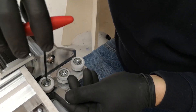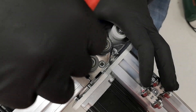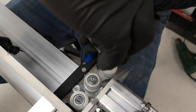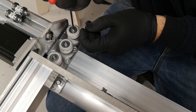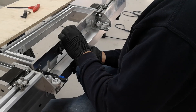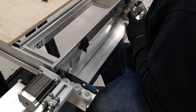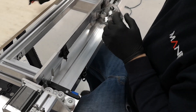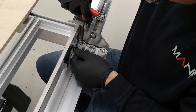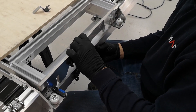Now we go and set the rest of the wheels. Initially, just get them all orientated in the same direction — get all the cams pointing the same way. Now they're all in and we just have to set the preload. There's not enough preload on those. Check the cams — in my case I need to give this one just a tiny bit more cam, more preload. Just lift it up and check again. Now it feels nice — let's put it back in.